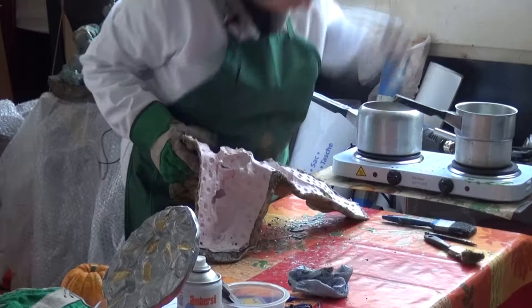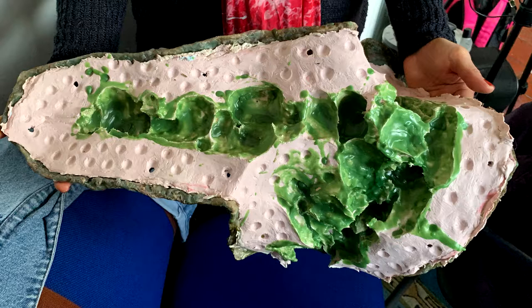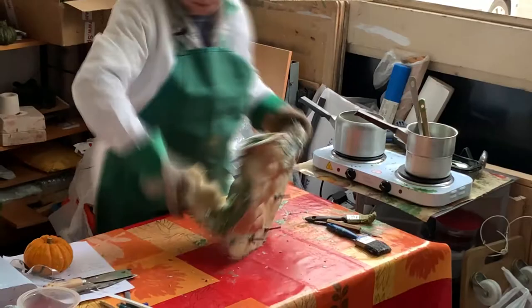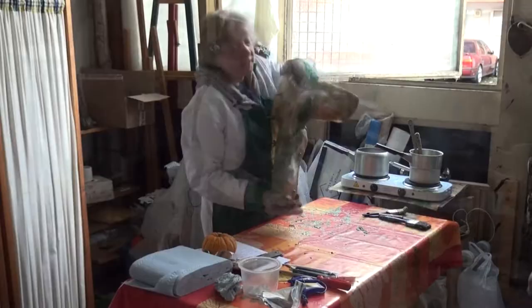So you can see I've taken off all the bits I don't need — now for the fun bit. What you've got to remember is that you've got seams, so you've got to try and swirl it around to cover as much as you can. You can hear it gurgle sometimes. This jacket will come off and then you're left with the silicone rubber sticking over the wax, so you're just going to have to gently ease that out.